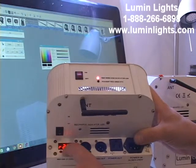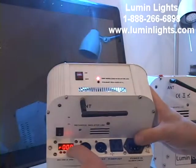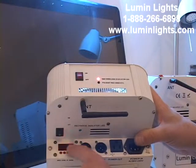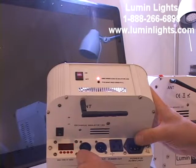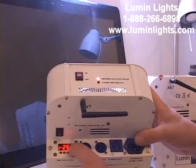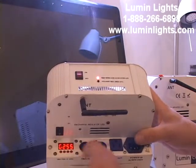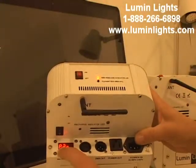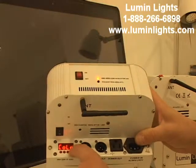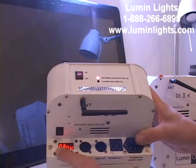Hitting enter on NANU shows R255 — the red LEDs at maximum brightness of 255. If I press up once more to zero, my red LEDs turn off. So if you ever find your lights are off or colors aren't mixing right, check your NANU setting in the color menu — you may have accidentally turned something off. You can adjust red, green, blue, and white/amber individually. Hit enter enter to save, then turn off and on or wait 15 seconds.